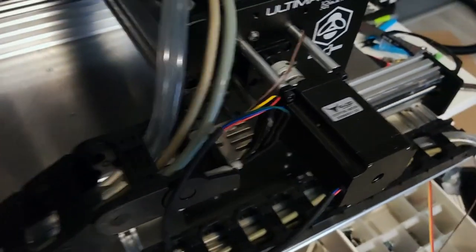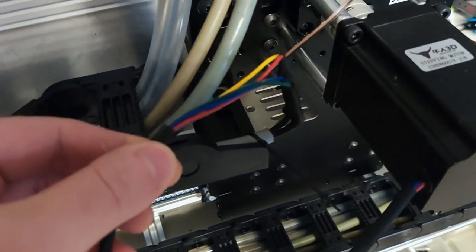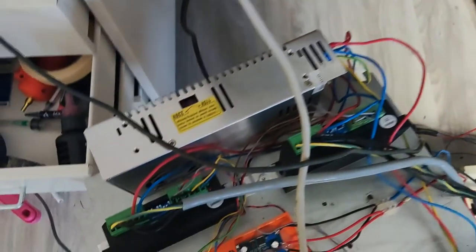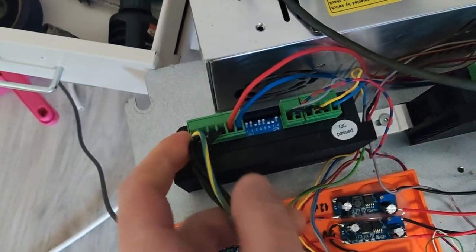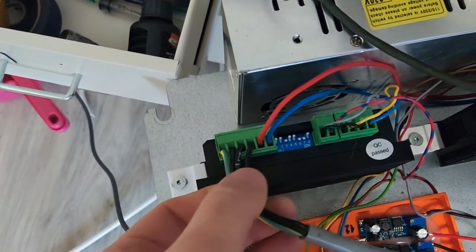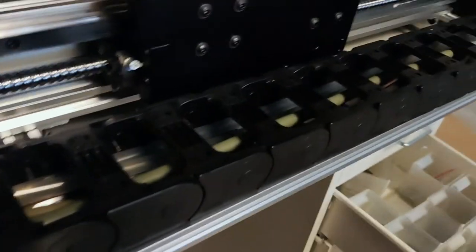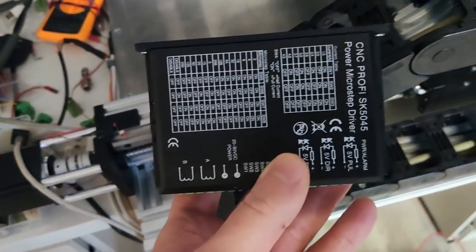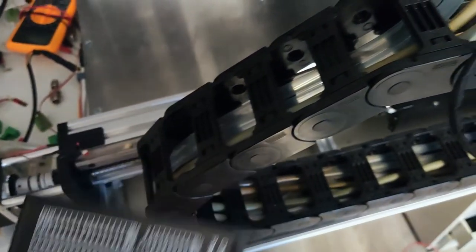When it comes to wiring, I can only show you how I did it on my machine, but the electrical side should be pretty much the same for others. The bare minimum is wiring the stepper motors. Each stepper motor driver needs to be connected to your motherboard with 4 cables: common ground, direction, step, and enable pin. Every stepper motor also needs to be connected to a stepper motor driver with another 4 wires: A minus, A plus, B minus, B plus. While they are usually labeled on the side of the stepper motor drivers, you will have to look at your motor's documentation to know which wire is which.